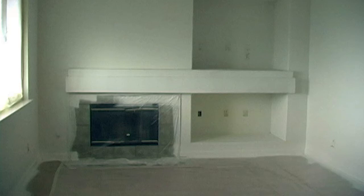Next, we will take semi-gloss Swiss coffee to paint the doors, trim, and baseboard. The goal again is a strong solid coat over everything. You can hold the sprayer about 6 to 12 inches from the edges to make sure the base and trim is covered. It is okay that you will have a few inches of overspray on the walls and the plastic.